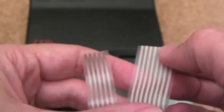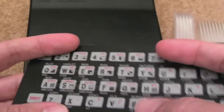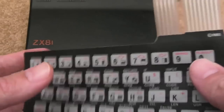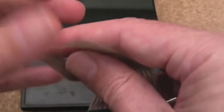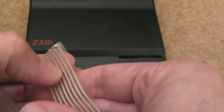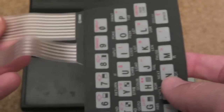It's ironic - I always say it's not this, it's not that, and lo and behold it is. I said I tested the keyboard, but with the exception of three or four keys up here they weren't working. I examined the ribbon and it had split right at the point where it joins the part that's not got the conductive material exposed - where it's covered with plastic. I've cut it at the point where it split, but you can't expose these traces again. So if you get that problem where it's split like mine had, you need a new one.